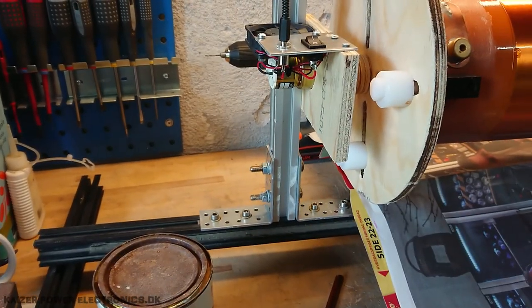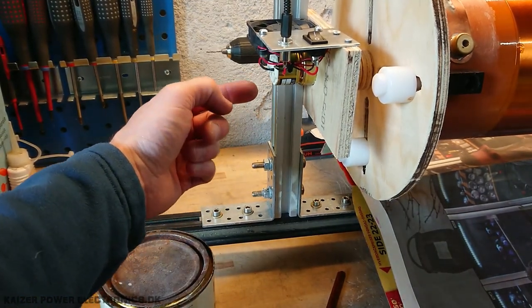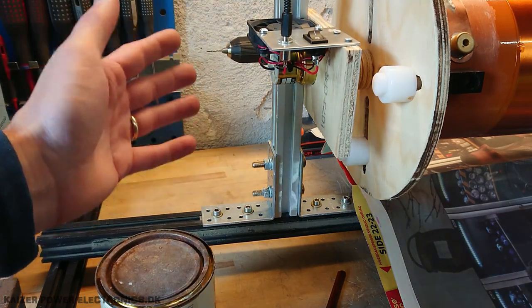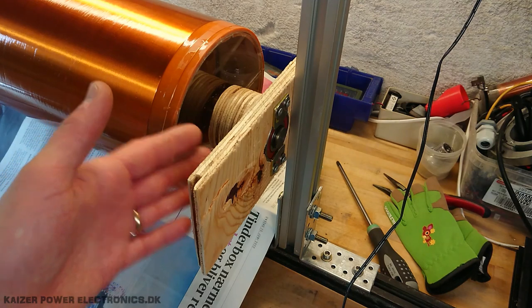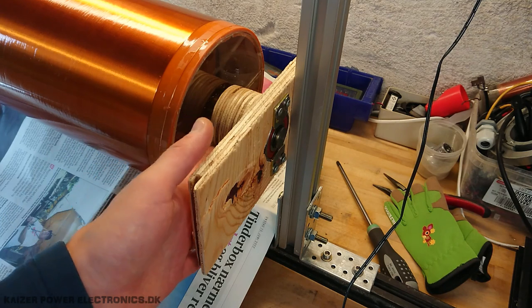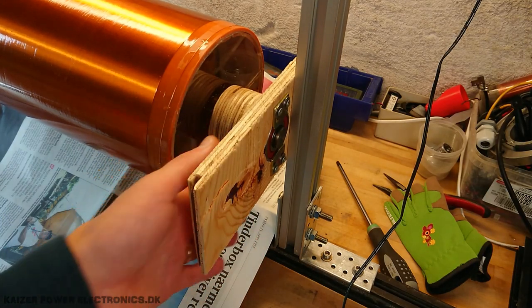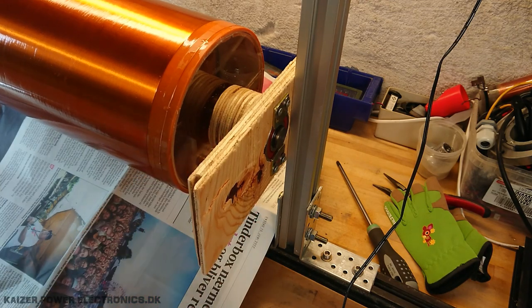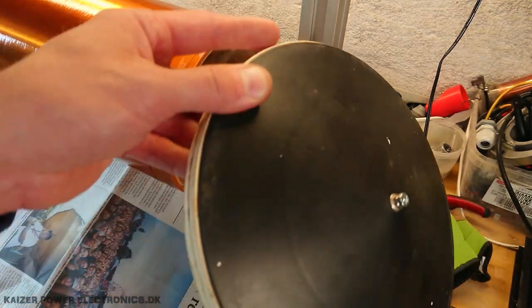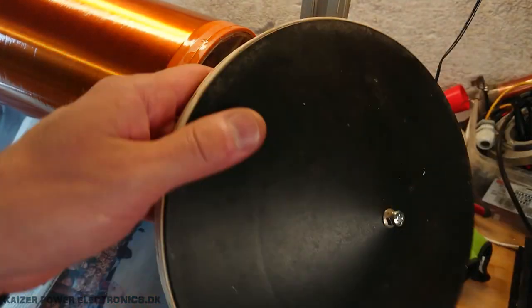Just get down here and see. That is a 12 volt DC gear motor, but I'm only feeding it 6 volt and I added a small fan because this will have to run for prolonged time. At the other end it's about the same story — some bearings from teardowns and plywood turned into this with a router, because I do not have any lathe. So to make round things I use a router with a center point. To hold really big coils, I have this conical plastic thing, also with a plywood interior.